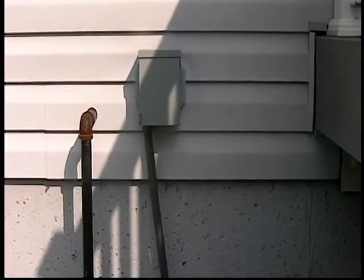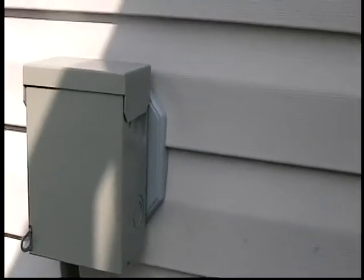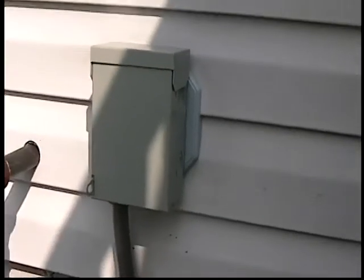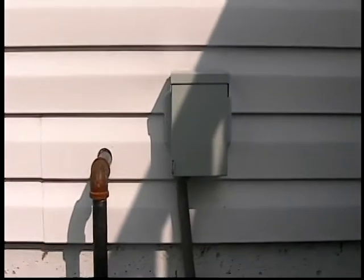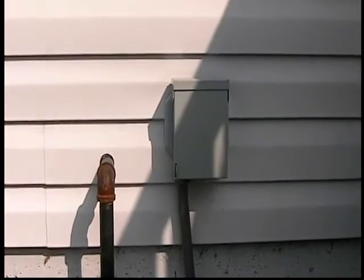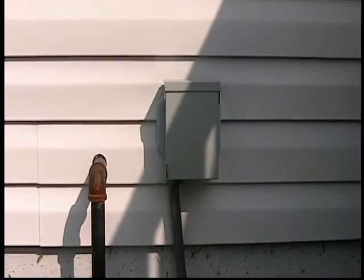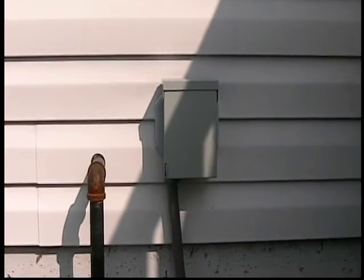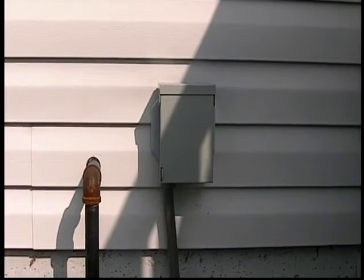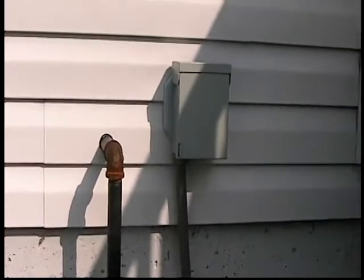One last thing I'd like to cover is when I put a disconnect on the back of the house, if there's vinyl siding or anything, right here you can buy these spacer blocks and I like to use those. I use the disconnect box — obviously you can disconnect the generator if you ever have to replace it — but I use it for a transition to get to the liquid-tight conduit. When I drill a hole in a house, I like to make sure I can seal it so no bugs and no weather can get back inside the house, so I like those blocks.